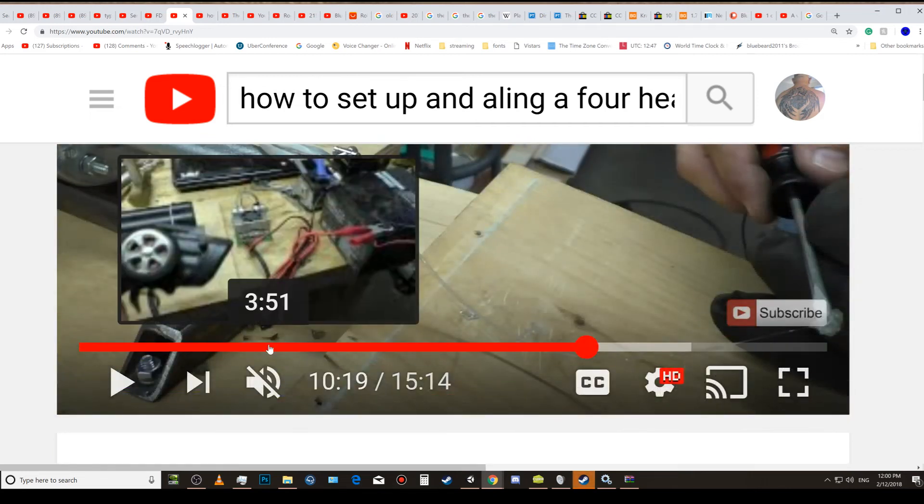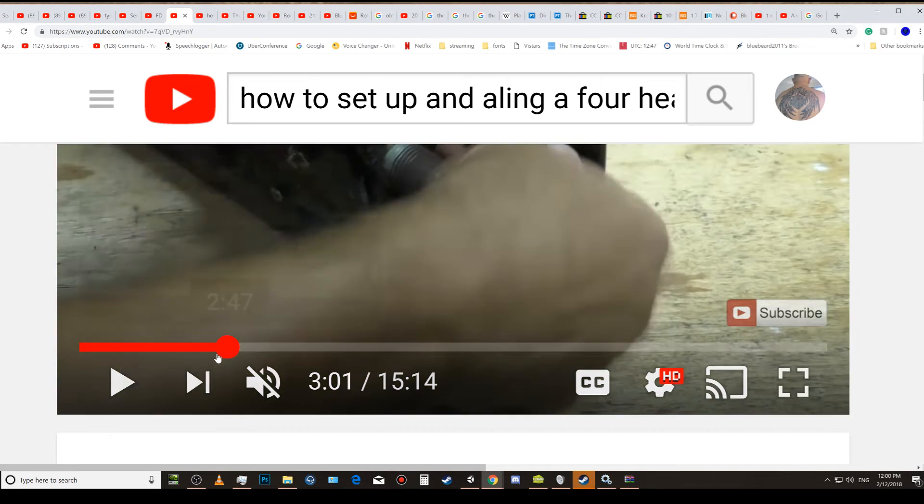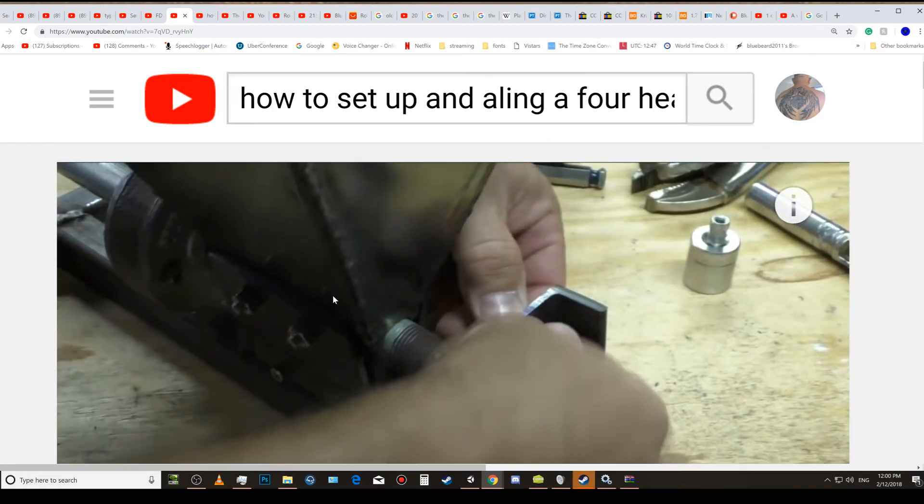He's got the wrong drill, but he's actually got a good little hopper — I was quite surprised. He's built a really nice little hopper. You've got to make sure there's no way that drill can touch the hopper. He's got the wrong sort of drill bit, so it's clunking — you can hear it going clunk clunk clunk in the video. He says 'oh don't worry, that's just it crunching the plastic,' but the reason it's crunching is because the pellets don't have enough time to fall down the hole.